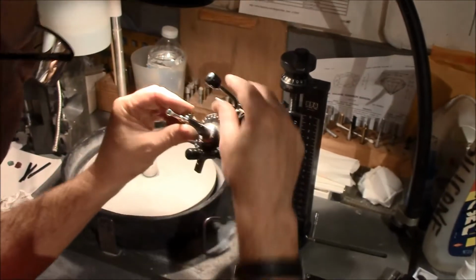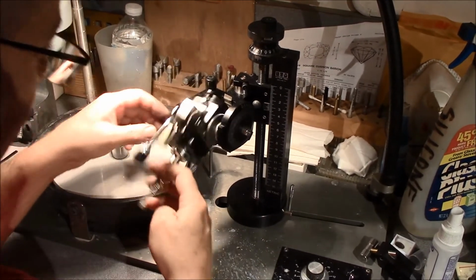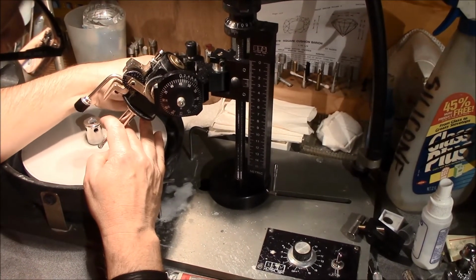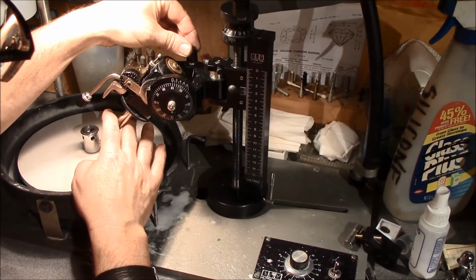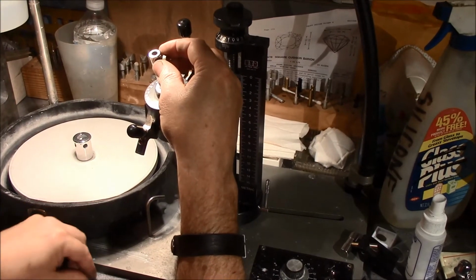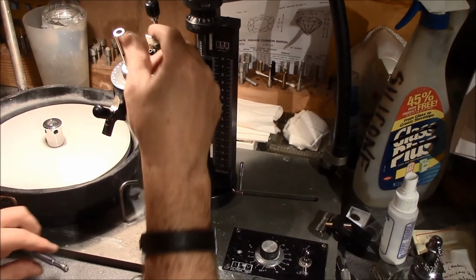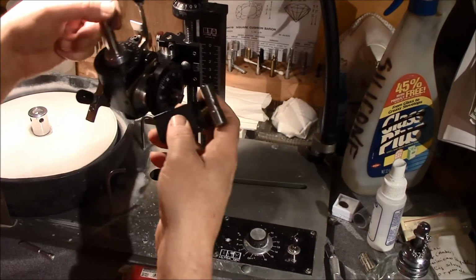It's time to transfer to the 45-degree or tabling adapter. It's at 45 degrees, so you will set your index or your caliper dial at 45 degrees. So that's 45 on that, take this out of the quill. I usually remember what end my angle is at. This is at 3, this came out, it was at 3 o'clock. In case I ever have to line it back up in case I mess up something.